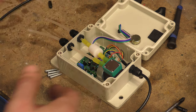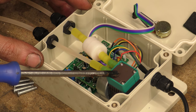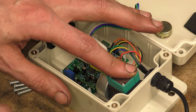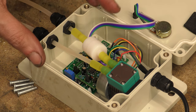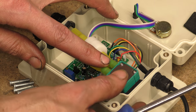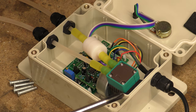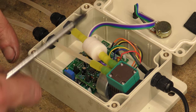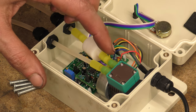Here it is - this part here is a diaphragm pump, and on the diaphragm pump there is a stepper motor. Being stepper motor controlled means you have infinite fine control of how much the pump runs and how much fuel is injected. These are not off-the-shelf diaphragm pumps - the main body is off the shelf, but it is reworked with nitrile interior. The pump membranes are nitrile and the pump stroke is modified for the small quantities they are using. Part of the building process is taking these pumps, ripping out all their insides and replacing them with fuel-rated components, and adding a stepper motor to drive the pump.